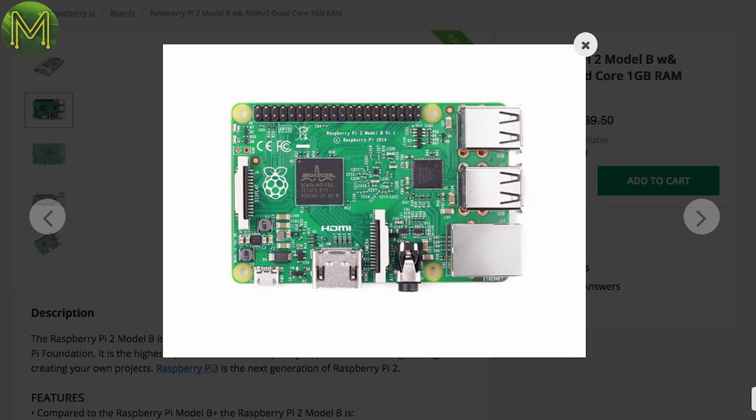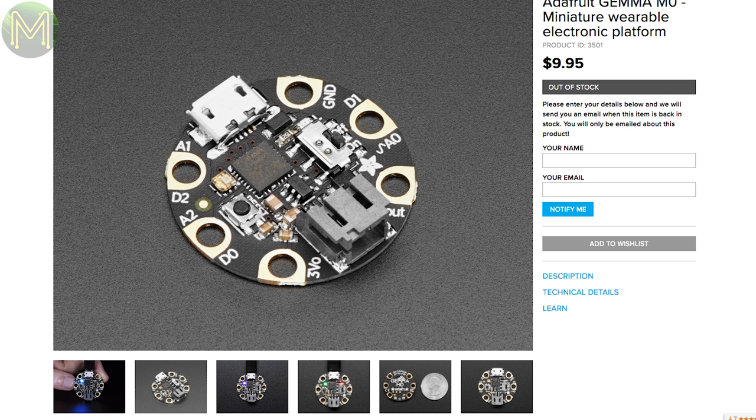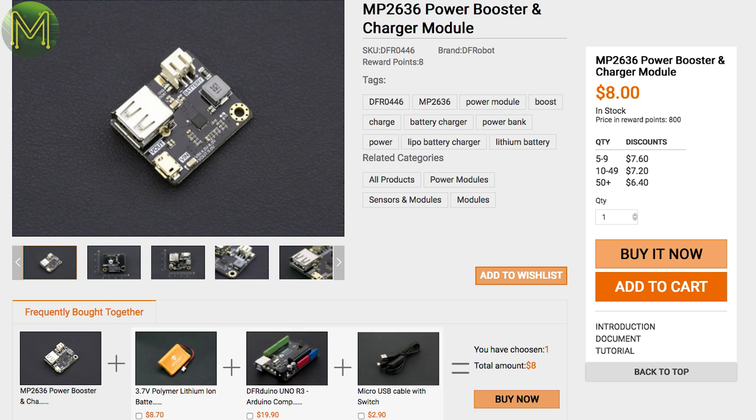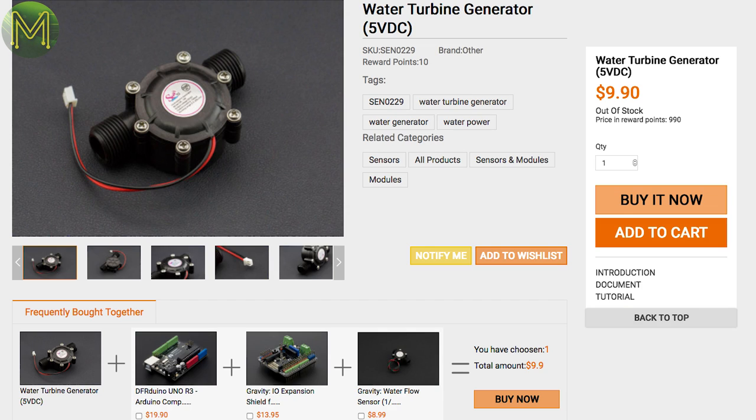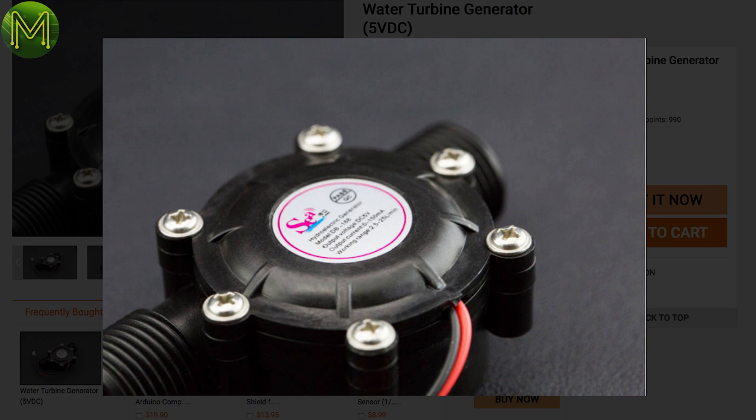However, it's only version 1.1 of the Pi 2, so it's not using the current generation of BCM2837 SoC as exists in the Pi 3. Adafruit have updated the Gemma M0 from the ATtiny85 to the SAM D21 MCU, and it also contains LiPo battery support on a sewable PCB. Over at DFRobot, they have a LiPo charging and boosting module based on the MP2636, and a water turbine generator that outputs a constant 5V at 150mA from a 4L per minute water flow, starting to push out 2.5V when hitting 3.5L per minute.